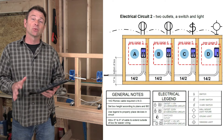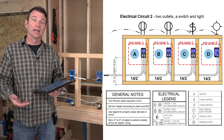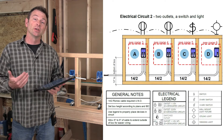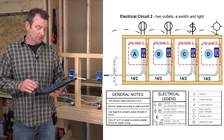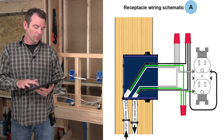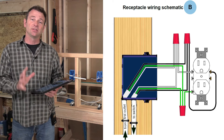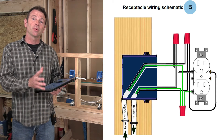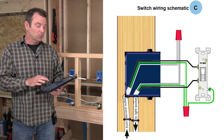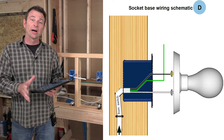It's also giving us some general notes that we can apply. For instance, 14-2 wire is in our general notes, so we know that whenever we're using cable, we're going to use 14-gauge 14-2. The last two pages are showing us close-ups of each junction box. As you work through each box, I'm going to start at the beginning of the circuit and work to the end. Each one of these close-ups will give you the details to get you through each wire-to-wire or wire-to-terminal connection.